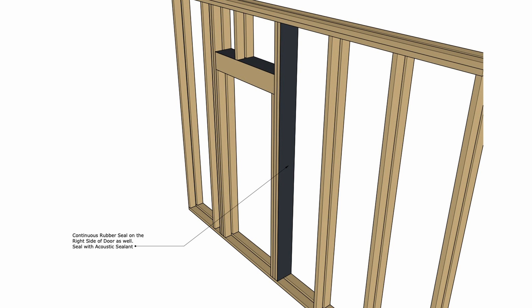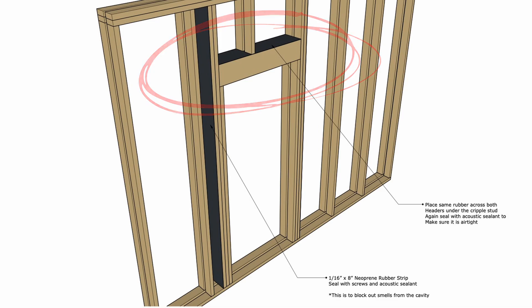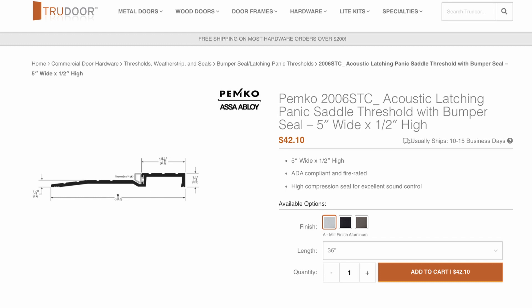Whatever way you want to adhere the rubber is up to you and your contractor. The main point is that it's airtight — this will block nasty smells that can accumulate from the air cavity into your door area and then into your studio. It's also going to ensure that we can put, as I'll talk about in part two of this series, some one-inch Corning 703 in that gap and then cover it with fabric so it looks like a nice finished seal, even though those two walls aren't actually connected with wood or metal that would transfer sound easily. Also notice that the rubber seal would go on top of the outside of the header, and then you could put your cripple studs on top of the rubber — this way we guarantee that the one-inch air gap on our header is also sealed up. You won't need any rubber on the bottom because we'll be cutting out those studs on the bottom and putting in a threshold for the door.